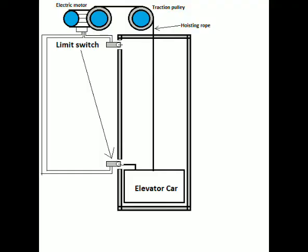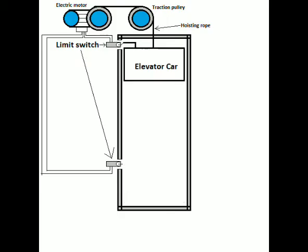Before we proceed with the operation of the forward-reverse motor control diagram, let us proceed with the example on the conventional elevator. Consider the upward direction as the forward rotation of the electric motor, while the downward direction is the reverse rotation. The limit switches have two wire terminals connected to the motor control terminal. A limit switch acts the same way as the stop push button, which interrupts the flow of current through the magnetic coil of the magnetic contactor. Its movable lever opens its internal electrical contact when it is hit by the external object, causing a disconnection from the power source of the electric motor. When the external object in contact with the movable lever is removed, the electrical path will then be closed again, allowing the flow of current if the start push button is pushed, whether it is forward or reverse, one at a time.